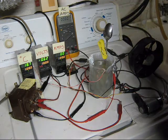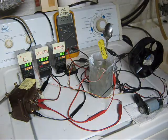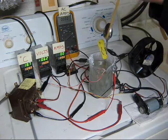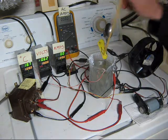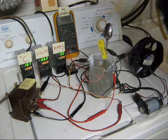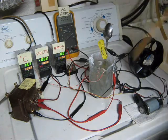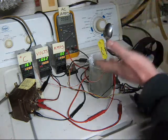And this, I got minus 620 millivolts or so across this, keeping in mind that this is an electrolytic cell, and because I'm using dissimilar metals, there will be some galvanic action here, and that's what we're seeing here. So this essentially is acting like a battery.